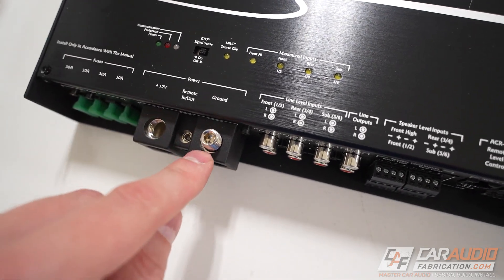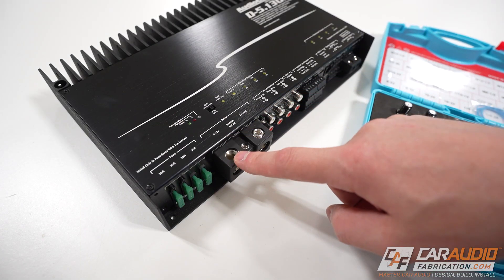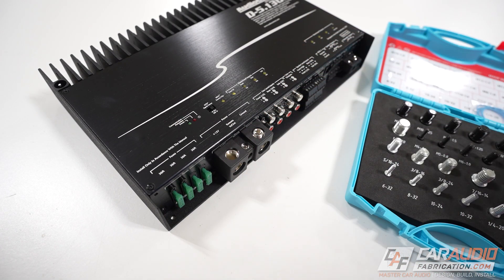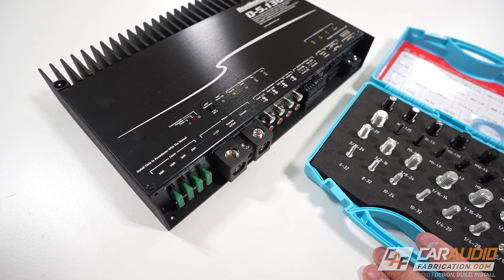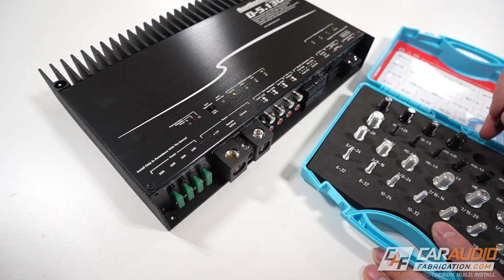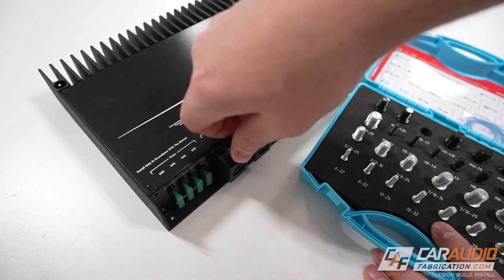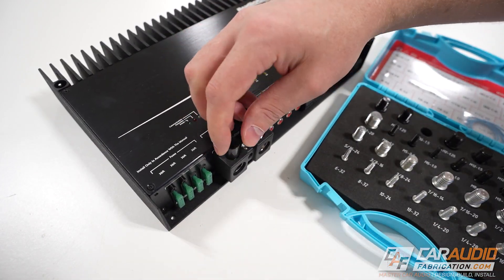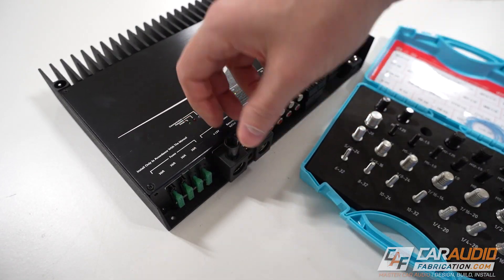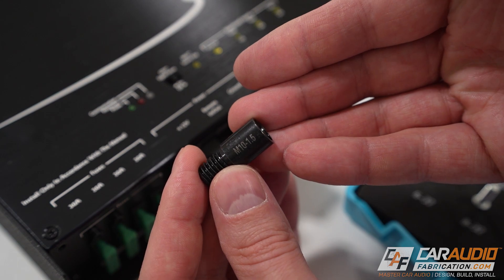In this video we're covering this style of set screw terminal, but if you use the other type, I'll talk about that later. Let's identify the thread size. I'm going to guess it's metric and start with a size that looks close. M12 feels a little too large, so let's move down. M10 turns in nicely — you don't want to force the threads — and it goes all the way down. So this is an M10 with a 1.5 thread pitch.